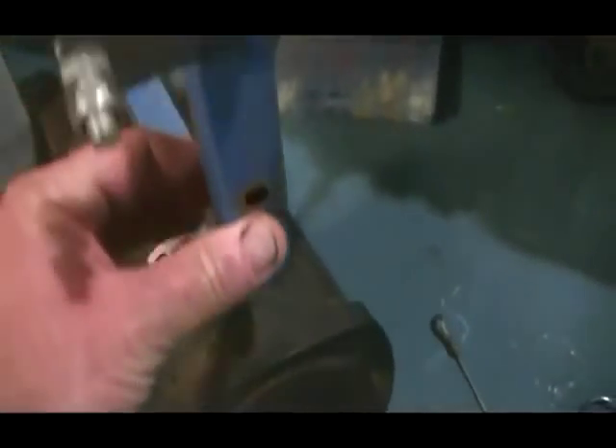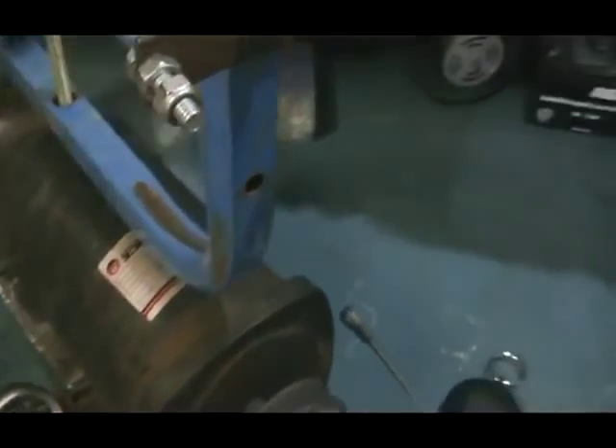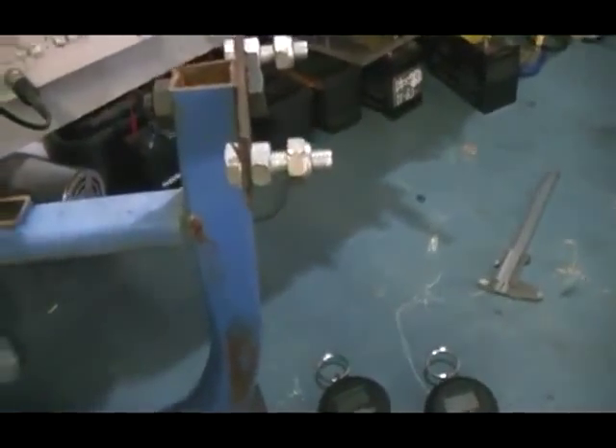My lifting device is not going to be hand operated — it's very hard to keep an accurate tension on the strap when using hands. Mine is actually going to be a mechanical lift setup and I can adjust the tension simply by screwing this down, which lifts that up.